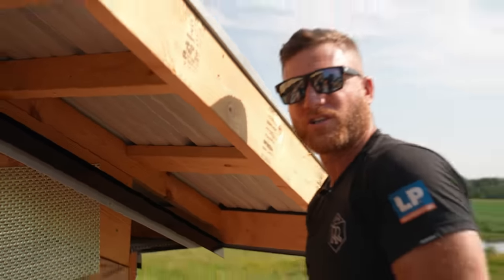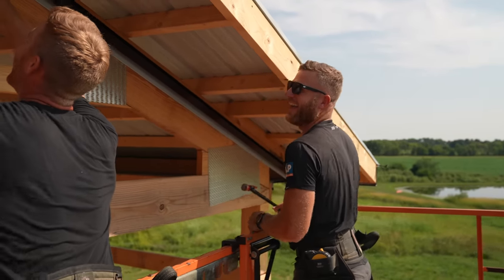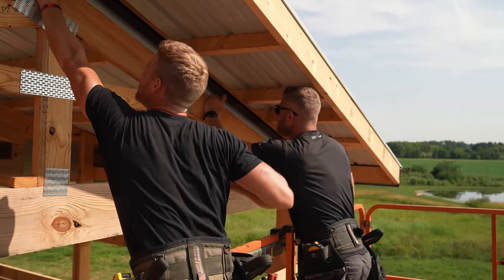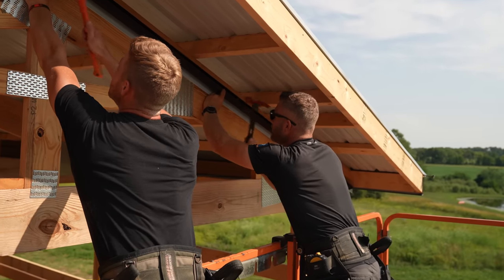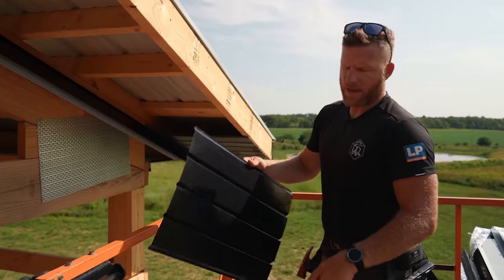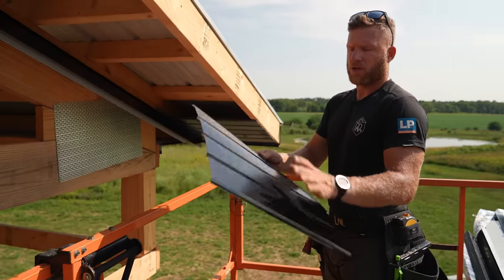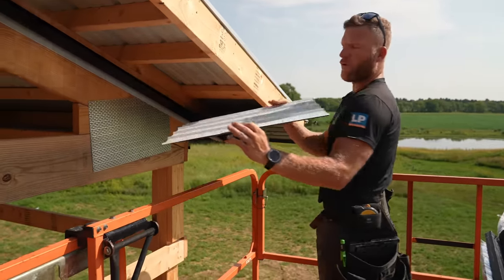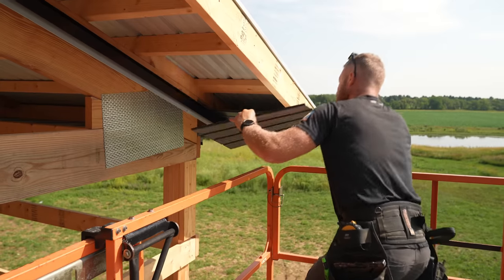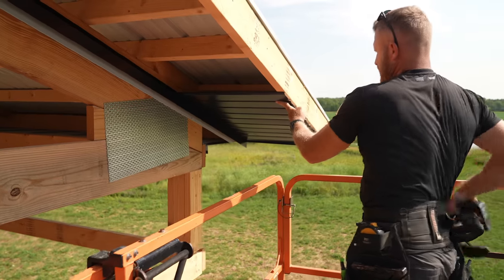You guys remember when we put these trusses up? Greg had the bright idea — well, he just remembered first — to snap lines on the end of this truss. So when we got to this point we don't have to do any figuring; this trim goes right to that snap line. This soffit is pre-cut, done by MWI. MWI takes the steel from our metal supplier — the exact same black 29-gauge metal — and then they roll-form and cut these pieces so that we don't have to. So instead of getting a 12-foot piece of soffit and having to cut them all down to size, we just build our structure with a two-foot overhang and this is perfect for it.